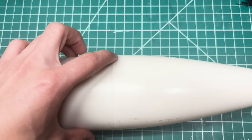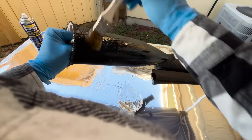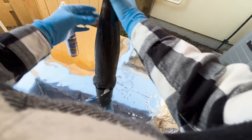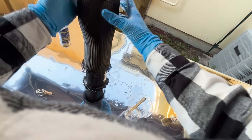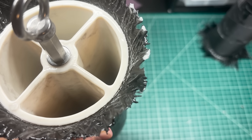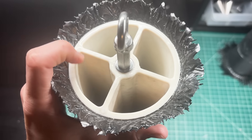Once the mold was vapor smoothed and re-hardened, I used paraffin wax to fill in any obvious cracks like the seam between the two mold halves. For the layup, I added two coats of spray-on mold release, then added the carbon fiber sleeves — this time wetting each sleeve out with a paintbrush first, which made the process way easier. One key thing: you can't pull these sleeves into place because pulling tightens and binds them to the part underneath. You have to push the sleeves into place from above — kind of like pushing ropes. After curing, I did two trips between the freezer and running the part under hot water; you could hear little pops as the mold started to release, and after the second hot water trip, the mold could be squeezed out.